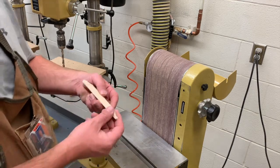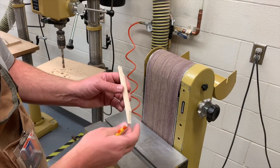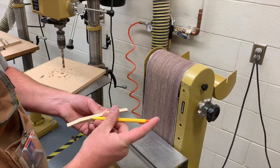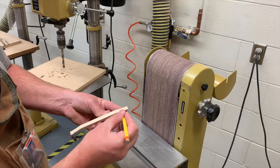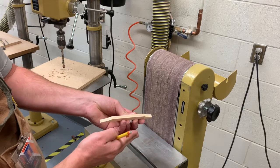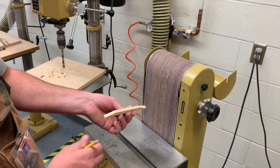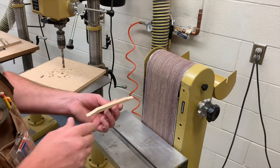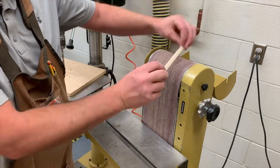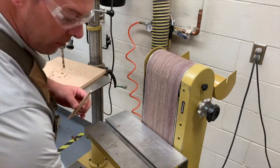And if you remember when we did our back bracings, same concept here. We want to just smooth them up, but also we want each one to curve up and make it more rounded. So I do like to draw some kind of center line on here, so I know sanding it up on each side, kind of just like a curve up on that. And just watch your hands on the sander, or you can just rock it back and forth and then get the other side, holding your fingers out of the way so you don't get hit on the sandpaper.